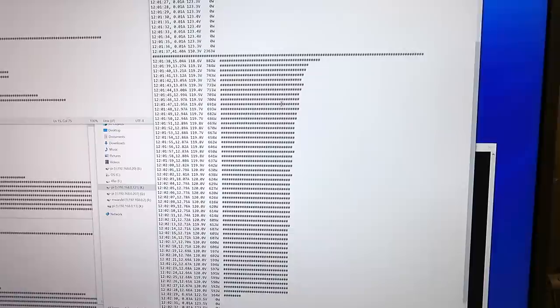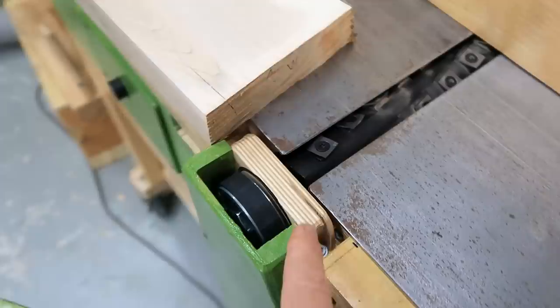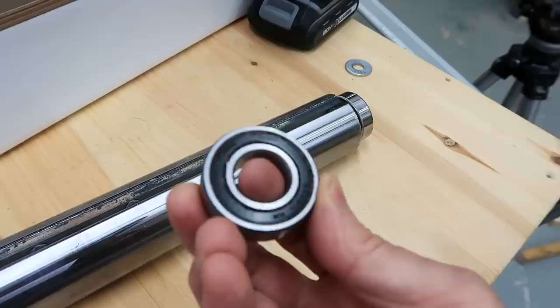As for those bearings and idle power consumption, quite often I see about 750 watts idling but then it always drops off — after about a minute it's down to under 600 watts. After that I can feel the ends of the cutter head a little bit warmer, so this is just a matter of the grease and the bearings getting warm. The bearings on the old head spin really freely, except they're not really supposed to do that — they probably need to be re-greased. This brand new bearing of the same size I just can't get to spin freely like that at all.